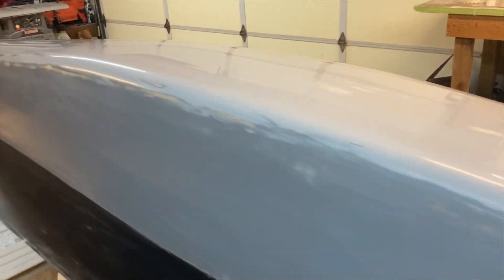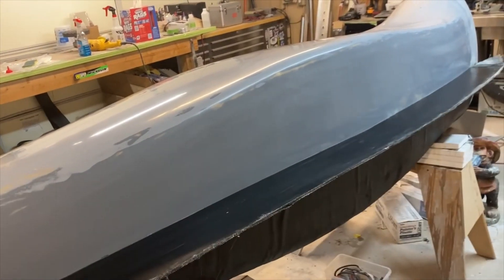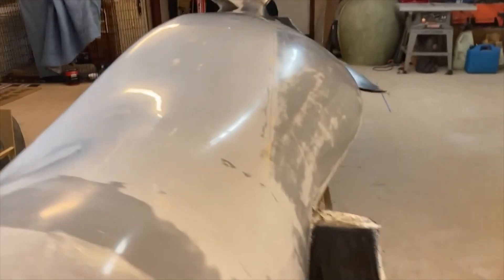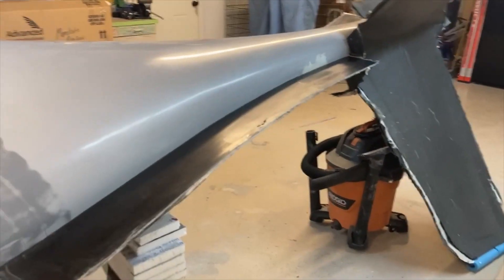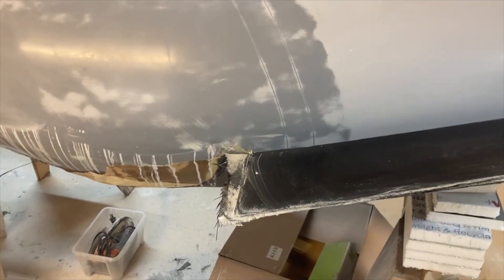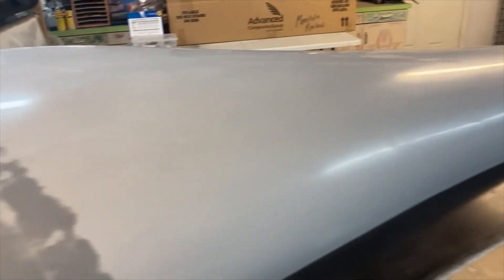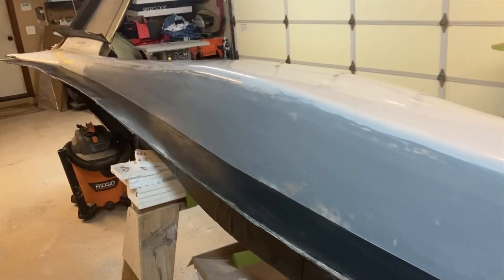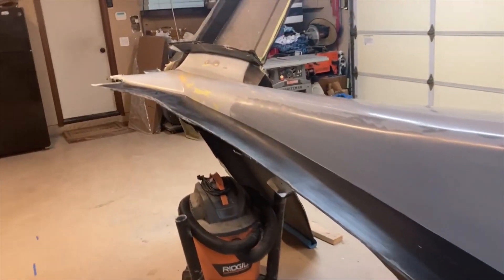I ended up doing a bunch of work off camera — that's typically how it goes. What I've done is finished sanding the whole fuselage to 2000 grit and then hit it with the buffer and some compound, so you can see it's already shining up pretty nicely. Next step is to hit it with Finesse, which is a finer compound that will actually bring out the shine. I've got to go around and clean up the splitters in a couple of places — there's still some PVA on them that's kind of a pain to get off. Unfortunately I'm leaving in a couple of days for the Reno Air Races for over a week, so this won't get molded before then, but it will be done soon after I get back.